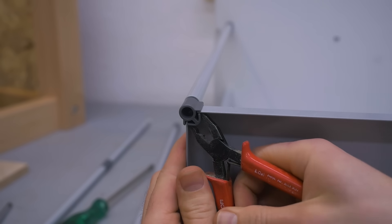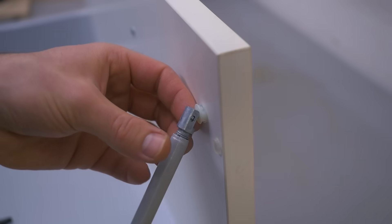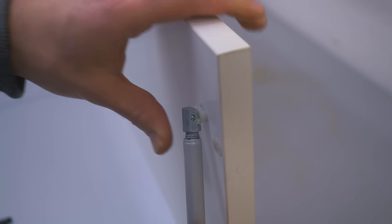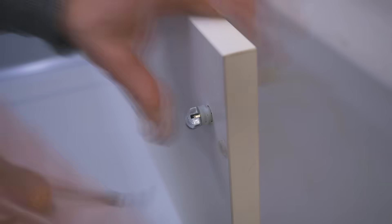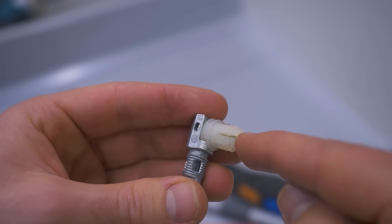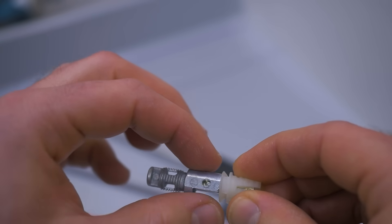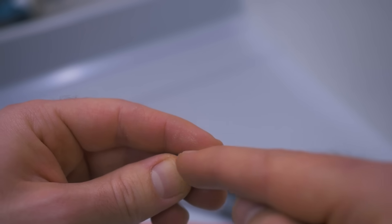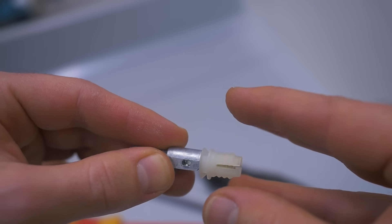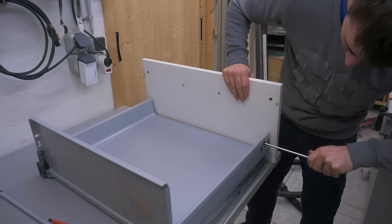This piece is usually just snapped into the corner. In the front there's a neat little mechanism — it can be tilted down and pulled out. It's a plastic anchor with a conical bit in the front, and as you straighten it out, a cam lever pulls the metal bit back, which spreads the anchor in the hole and holds it pretty well in place.